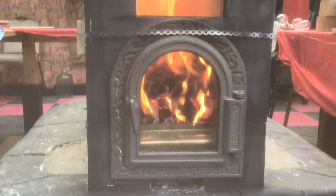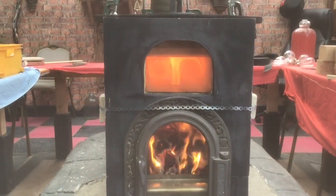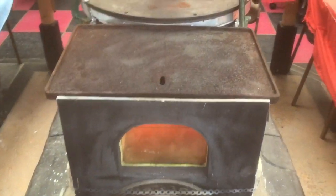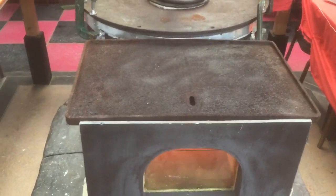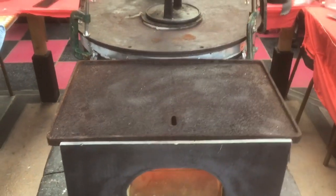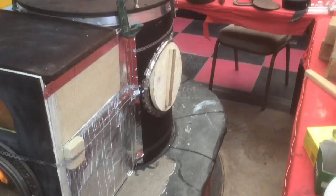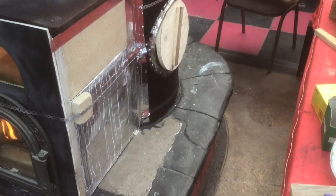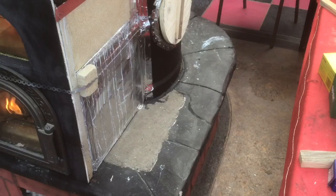There's still a fair bit of wood in there, so it's definitely a better burn than yesterday. It seems that the ceramic glass sitting on top — before I put this plate on — was responsible for releasing too much heat; it obviously wasn't containing the heat as it should and wasn't sending it down through the barrel and into the mass. I put a couple of wooden plugs on the end of my oven piece, and inside the temperatures are going up to 190, the very base of the barrel is about 140, and the mass is now up to 50 degrees C.